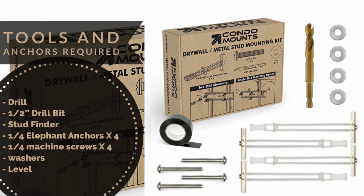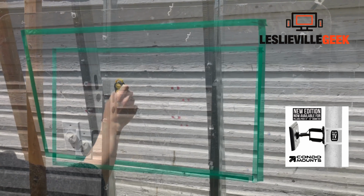Today I'm going to show you how to mount a TV on a metal stud wall. You need a drill. For that drill you need a 1/2 inch drill bit, a stud finder, elephant anchors, 4 of them minimum, machine screws, washers, and a level. You can either buy them as a kit or buy them separately.